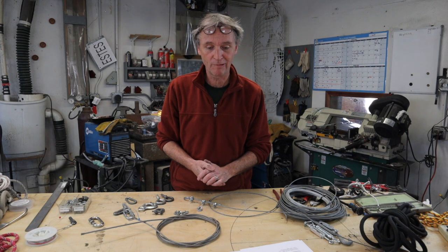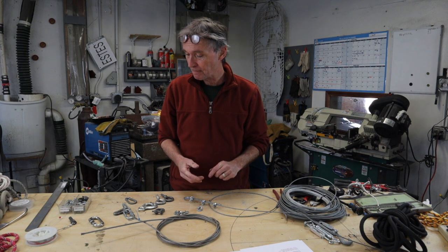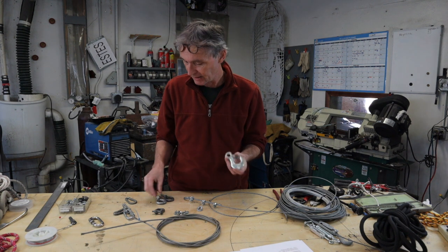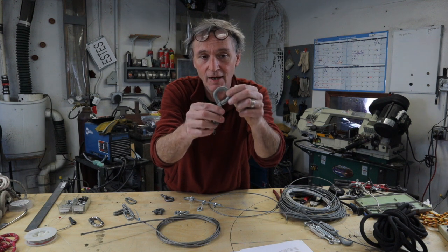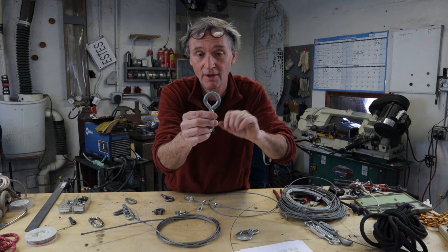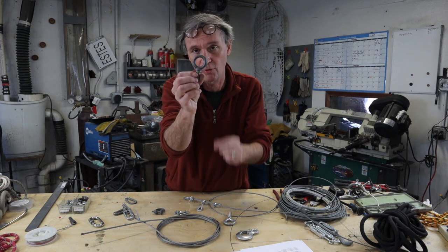Check it. Check it twice. Get a professional. Do not hang people from the ceiling. Do not hang yourself from the ceiling, even if you're wearing a little harness. It's a game for professionals, not for amateurs. A lot of this hardware is rated. For example, this is an eye bolt, but you can see the eye is not continuous — it is not connected. If you put a lot of weight on this, it will open up and become a J-bolt and then it will become nothing at all.